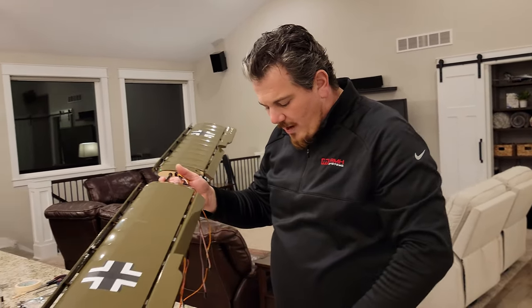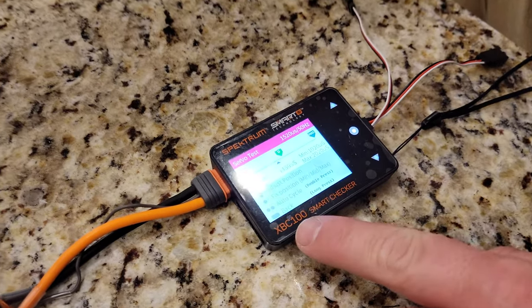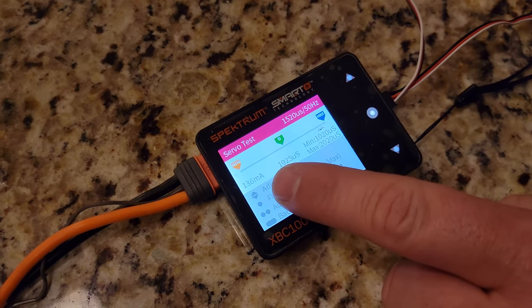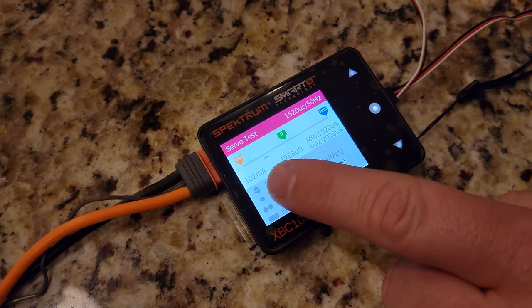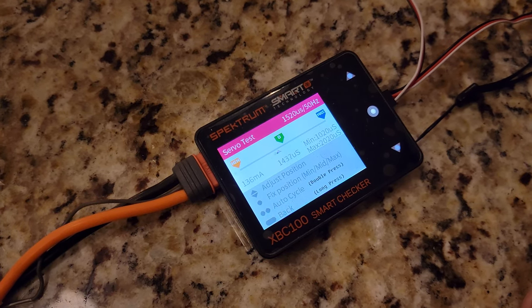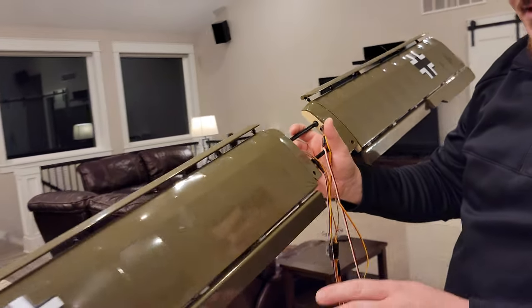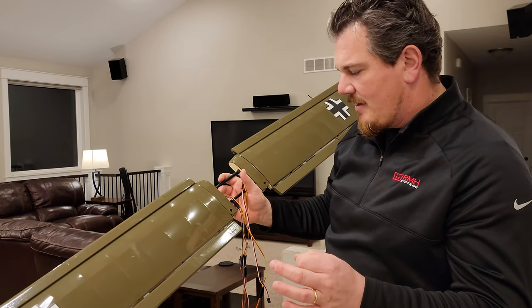And you can also watch the loading on this XBC 100. See how it says 170, 172, 102, 136, 102. There, we have a little bit of bind. It goes to about 300 milliamps, not milliamp hours. Boom. And what's happening is that somewhere through this sweep, there's a spot where it's bound real briefly, probably at the end of stroke.